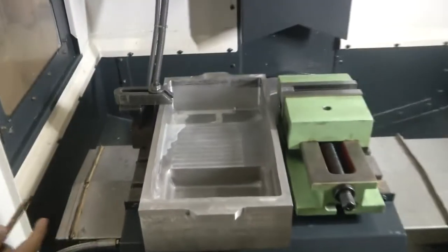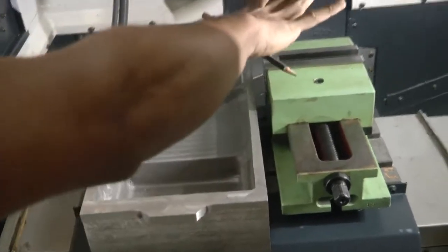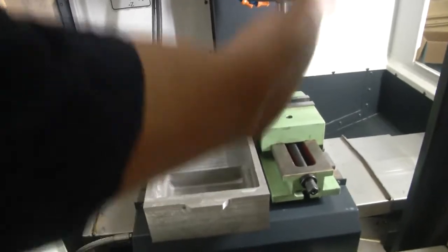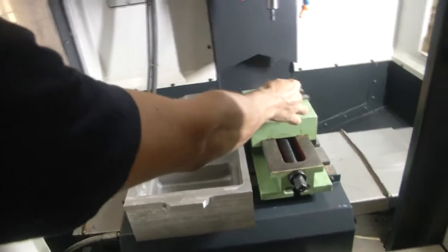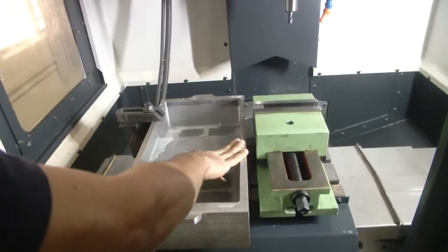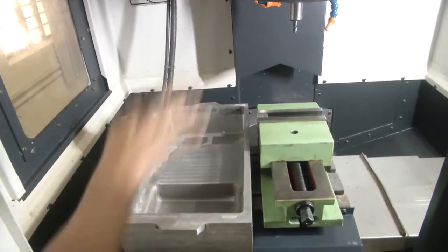This is the homing operation, where wherever the workbed or the tool station is, the tool will first move in safety from its position to the safety position. That will be the home position of the tool. From wherever the Z value is, it will move to 0, and wherever the bed or the workstation is, that will move to the home position. X, Y and Z are 0 at this position.